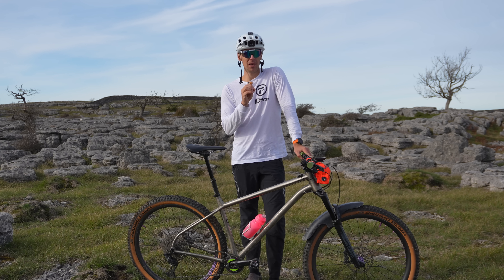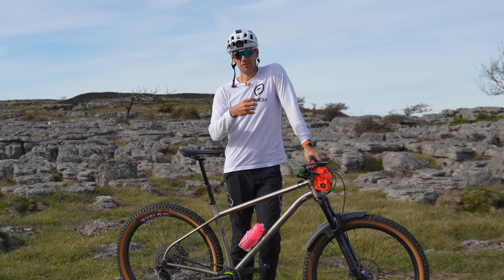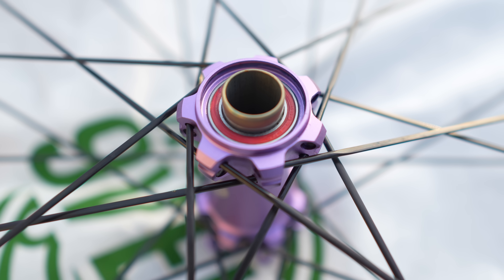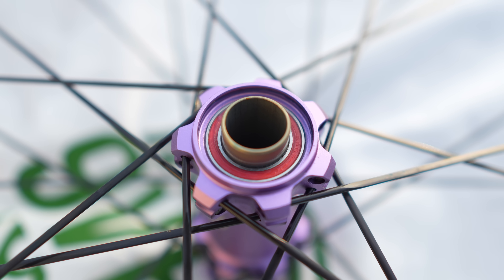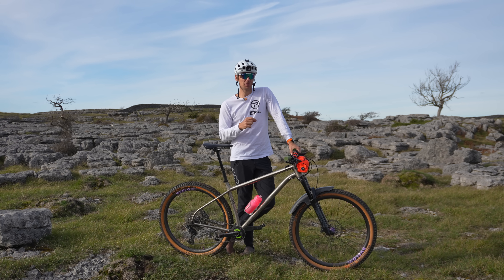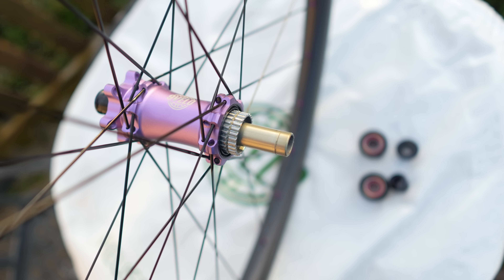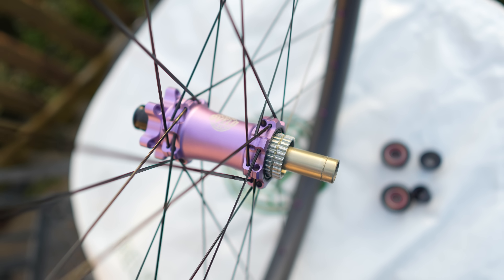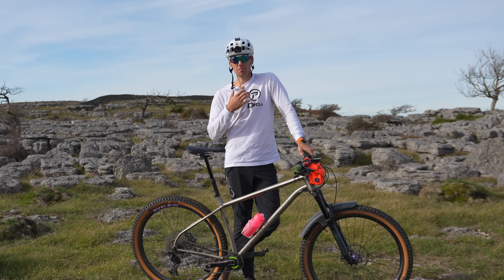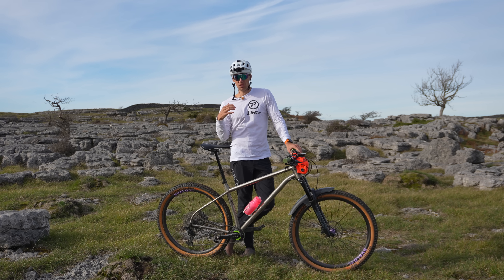They produce the axles and the bearing shell machining down to one or two microns — that's 0.001 or 0.002 millimeters. If you don't know what I mean by engineering fits and tolerances, that comes down to how the shafts and housings interact with the bearings and axles inside the hub. You might not think that's very important, but it's super difficult to get right — it comes down to these tiny microns of tolerance, tolerance stack-up — and it all affects bearing life, noise, wear, and preload. It's quite complex to do repeatedly in mass production. DT Swiss do it with the 240, one of the best hubs in the world, and I would say this is up there in terms of that level of repeatability and machining quality.